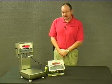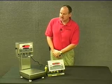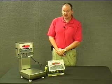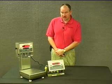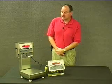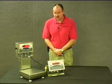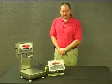The CW90X features a piezo keypad, which is a keypad that has no moving parts. It is designed to withstand knife cuts. You could actually stab the zero button on this unit and it would not stop functioning and it would not ingress water. The CW90X is IP69K rated.